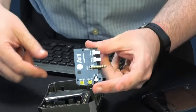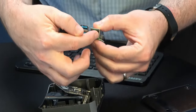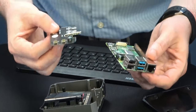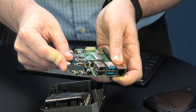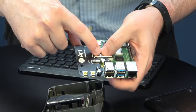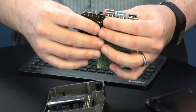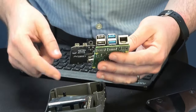This is cool. One of the things with a Raspberry Pi, or any single board computer, is that you've got connectors all around the board — ethernet out one side, HDMI out the other, power here, video there. So what they've done is provide an adapter that plugs into the board at the headphone jack and dual HDMI output, putting all of those jacks directly onto the back of the Raspberry Pi. I'm giving it a nice snug push, being careful to hold the board at the connector points so I don't break any solder joints. This puts the audio, dual HDMI, USB, USB 3, and gigabit ethernet all at the back.